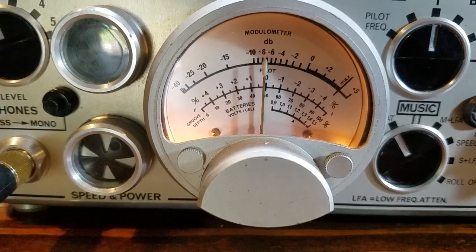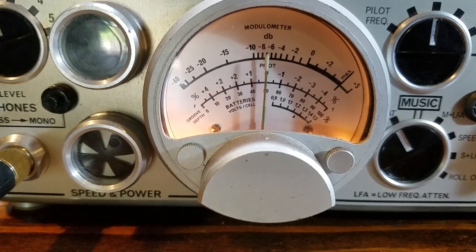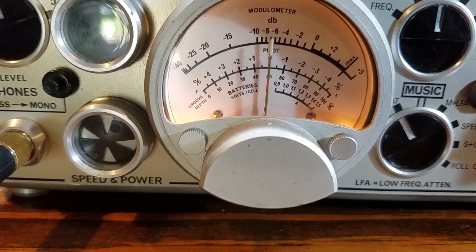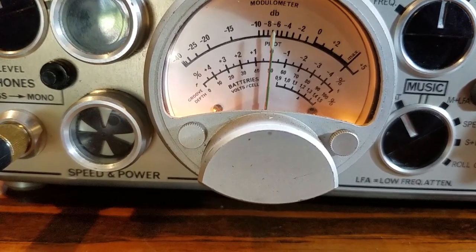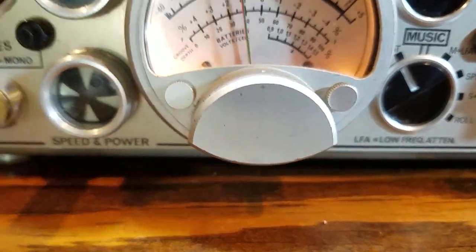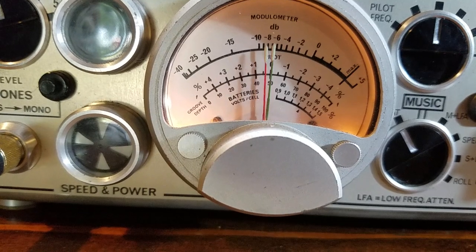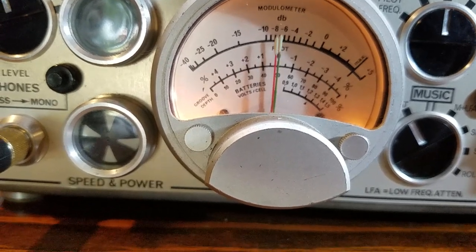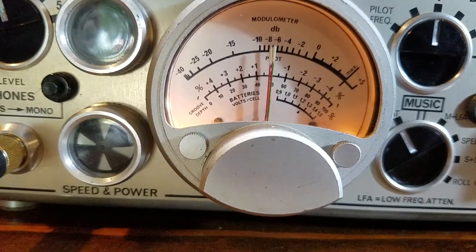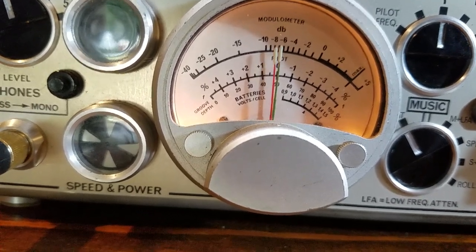And now we're going to play back off the tape head. You'll see when there's a tape dropout, the meters will fluctuate a little bit, but this is a pretty well-used piece of demonstration tape. At 10 kHz, we are maybe plus 3. Let's go up to 15 kHz. So it's feeding 15 now — you and I can't hear it, certainly a YouTube video won't reproduce it. But at 7.5 IPS, this is right off the tape — the needles are showing playback at 15 kHz, which is pretty darn impressive at 7.5 IPS, holding its own.